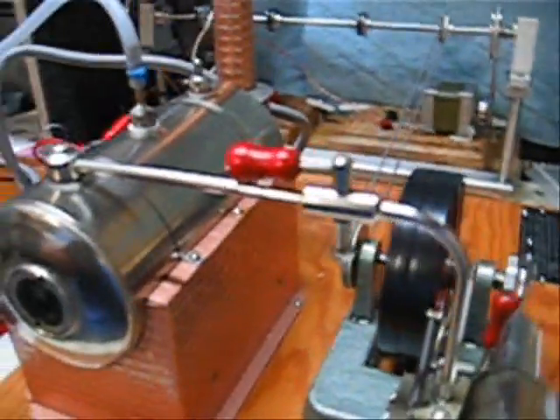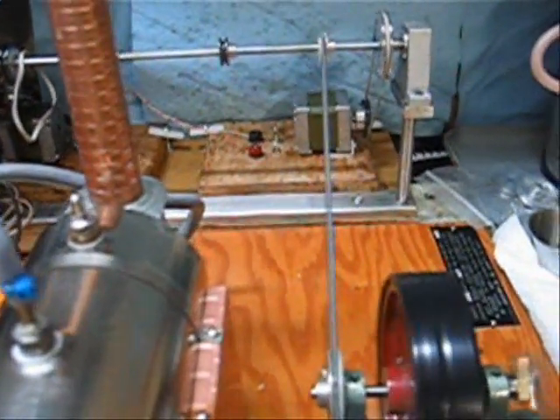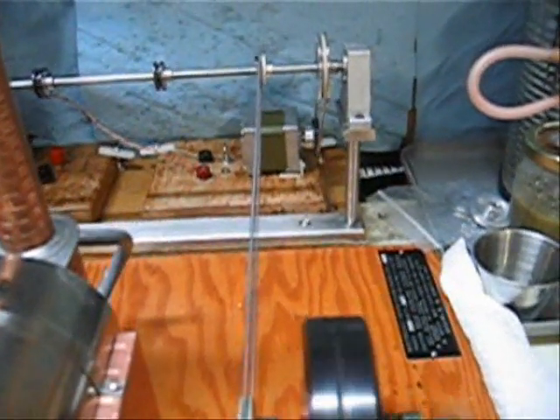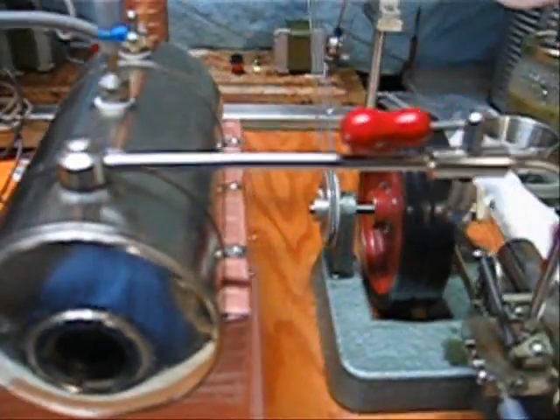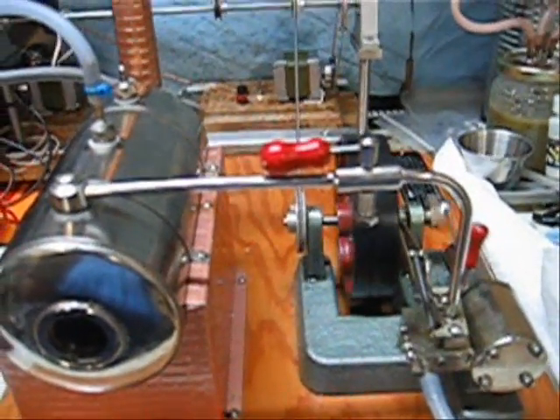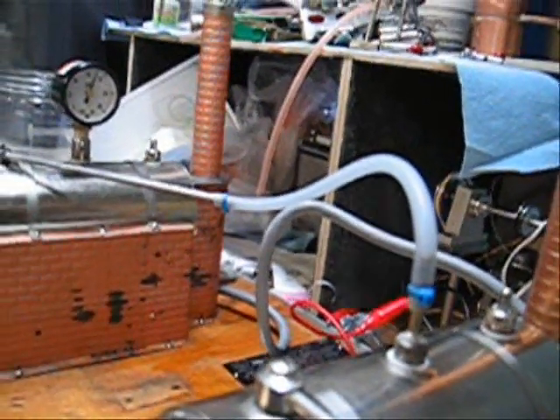Here's the double boiler 20 effortlessly lugging two stepper generators. The second one's not connected to any loads, but it provides a resistance on its own. Chugging along real well. Pressure's easily holding — in fact, it's still building up a little bit. About 17, 18 psi.